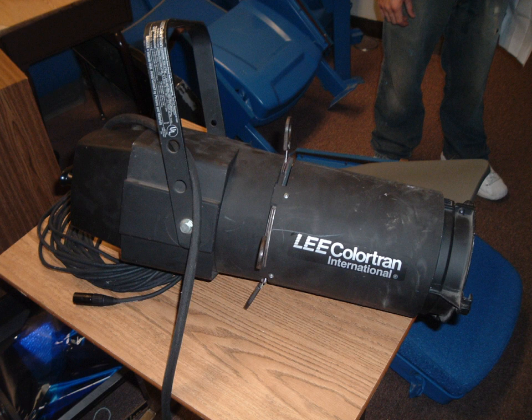In 2004, ADB introduced Warp profile. In this ellipsoidal profile spot, conventional shutters have been replaced by four integrated blades controlled by a series of rings, each with 360 degrees of endless rotation capability. Focus and zoom settings are also controlled by a set of dedicated rings. The ring controls leave the exterior of the Warp spotlight with no protruding handles or levers.